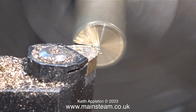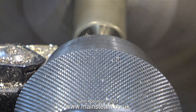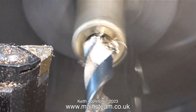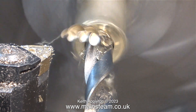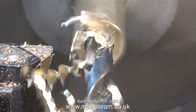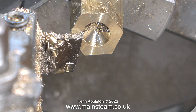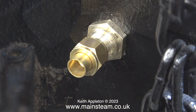After making the fitting and cleaning it up, it's time to make the nut that secures the fitting to the drag beam. It's a simple bit of plain turning — I face across the front, use a centre drill with a bit of lubricant, then follow with a twist drill which is tapping size for 3/8 by 32 threads per inch. Phosphor bronze has a really bad habit of grabbing things, as it just did with the twist drill. Once the twist drill got past the centre-drilled section it cut okay. This is a very simple part, but I'm showing it at length to demonstrate options and pitfalls, because making parts like this is a fairly common part of model engineering.